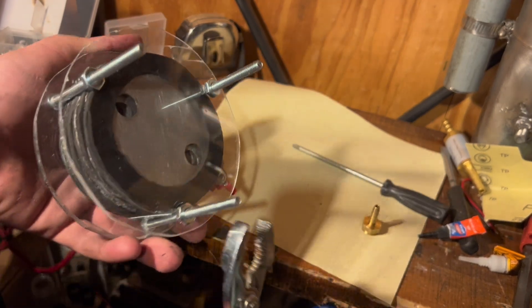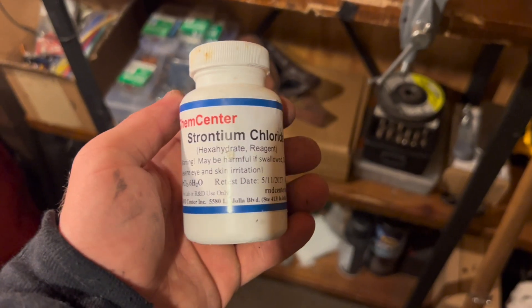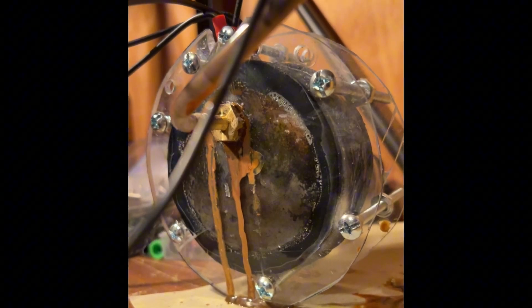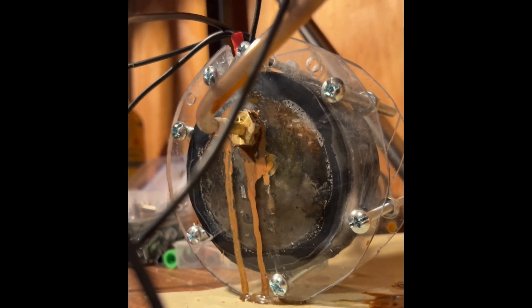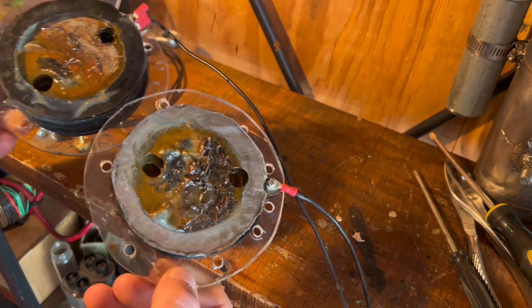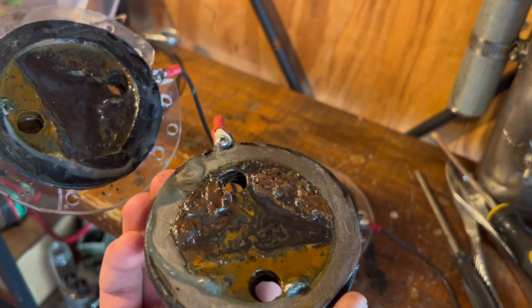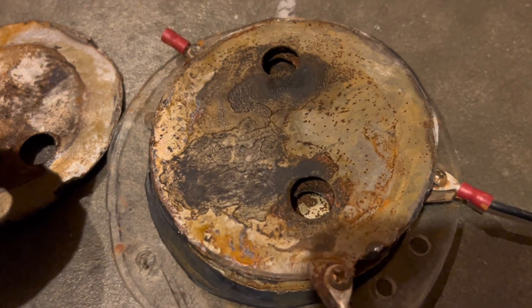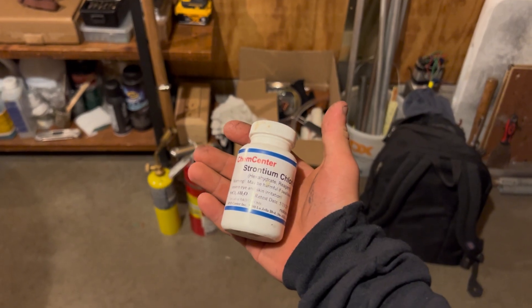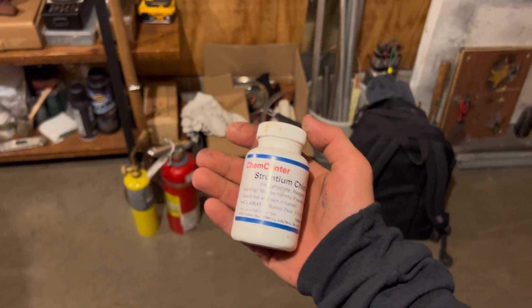And just like that, the reactor is ready. Now I didn't have any salt or baking soda to use as an electrolyte, so I tried using strontium chloride, which was a terrible decision. It corroded the inside of the reactor and the rubber gaskets, causing all the water to spill out everywhere, and basically destroyed the entire chamber. It formed some weird brown and black goo on the inside, which is very difficult to clean off. And even after cleaning, it's still going to take a ton of sanding and polishing to restore these steel sheets. I guess this is a pretty good lesson not to use highly corrosive chemicals in a reactor made mostly of plastic and metal.